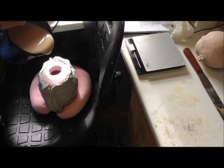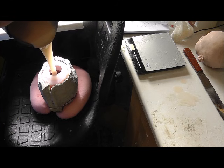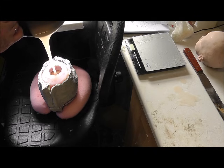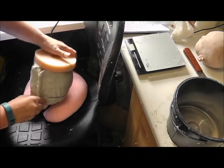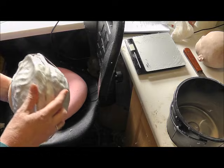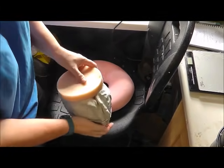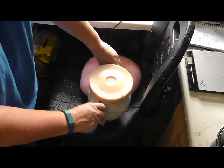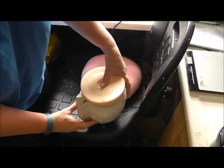The main problem with the head is usually the ears. It's really, really difficult to get both ears and earlobes out. Right, I'll do again every direction, including upside down. Knock it, rock it, tap it. Only small, but it's really important that the bubbles come out of these ears.